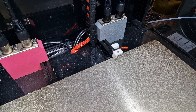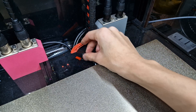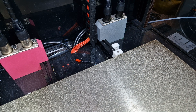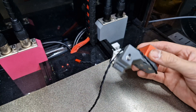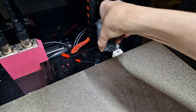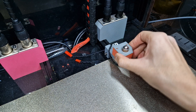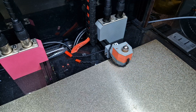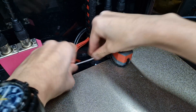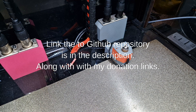Here we are at the printer. I've already run the other end of the switch to a switchboard on the controller. The mount piece shown in the previous video is already in place — you can go back there to see how that one is made. Put the probe in here like so and push it in place, then go around a bit to make sure it is sitting very still on the bed. Finally tighten the bolts, connect the switch, and that is your Loophole probe.